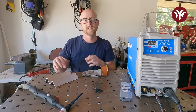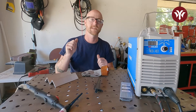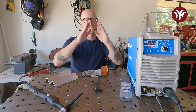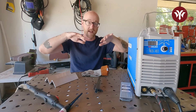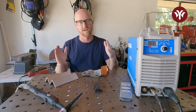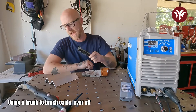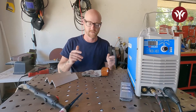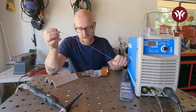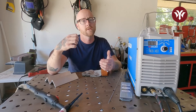The second thing is actually prepping the material itself. Aluminum has an oxide coating on it that gets thicker the longer it's been out in the environment. You're going to have to account for the cleaning action on your TIG machine. If you're using fresh aluminum, it's not that big of a deal, but you are going to see it when you weld — along the edges of your arc, you're going to see the metal start to bust up and crack. It looks like it's cracking but it's not — it's cleaning, basically exposing the bare metal to your arc and getting that oxide layer off. Before we start welding, we're going to try to brush as much of that oxide layer off as possible using a brush, really getting in the groove and cleaning the metal up as much as possible. Lastly, we're going to be using aluminum TIG rods rather than steel or stainless steel TIG rods. So let's get this fired up and actually start talking about torch position and how we're going to move the puddle, because the puddle moves much differently on aluminum than it does on steel.